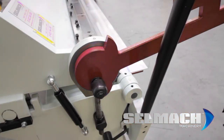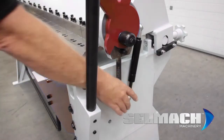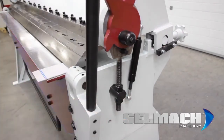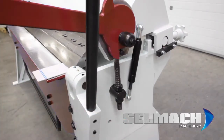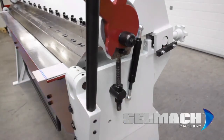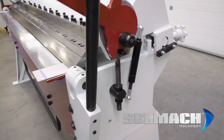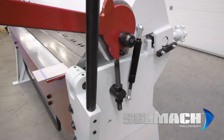That would be a good position for this end. We're going to set the other end now. Slacken that one off a little bit, pull down on the clamp — that feels a little bit loose so I'll tighten it up. Still feels a little bit loose. Tighten it up a little bit more and that feels perfect. You'll soon get used to the feel, because if it's too tight it won't clamp, and if it's too loose the job will push up when you try to fold it.